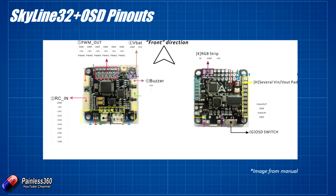Starting on the left-hand side there are the RC inputs — ground, plus five volts, and all the different channels. See the Naze 32 video for how that's wired up. That loom plugs into your receiver, and it supports PPM as well. If you're using PPM it's just the first three wires — ground, plus five volts, and channel one. Some of the other pins are there for things like GPS and sonar connections.